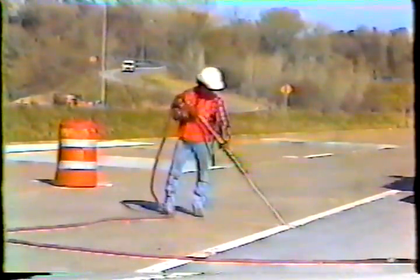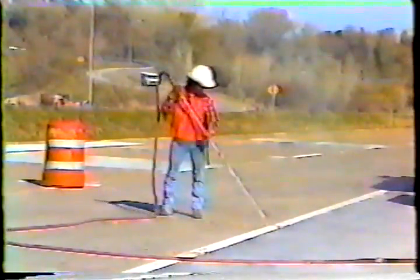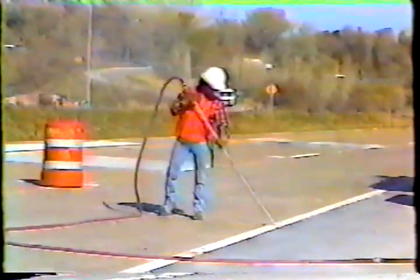When you finish sandblasting, there will still be residue to be removed. It's important to remember to air blast the spall again. Make it as clean as possible. With the cleaning process ended, the next step involves filling the saw cuts with epoxy.